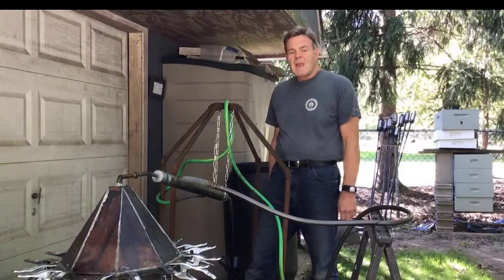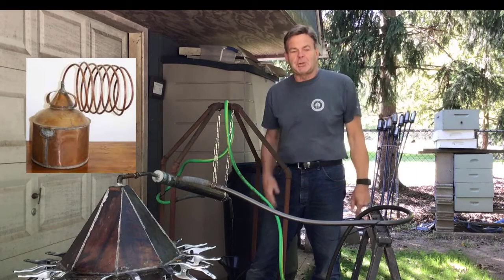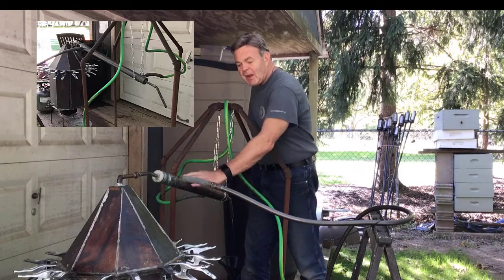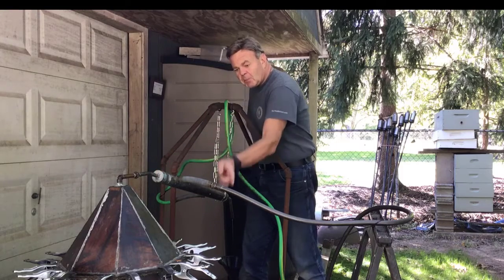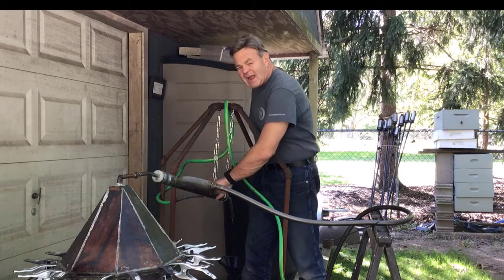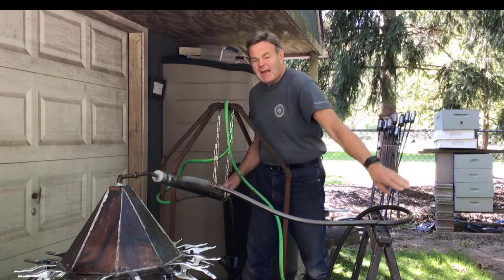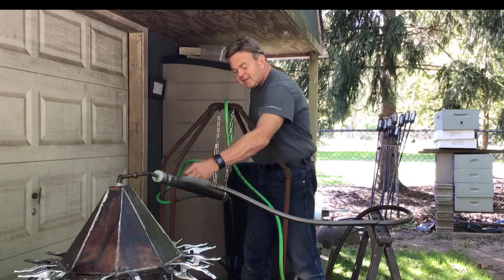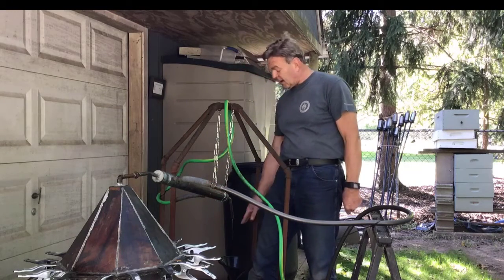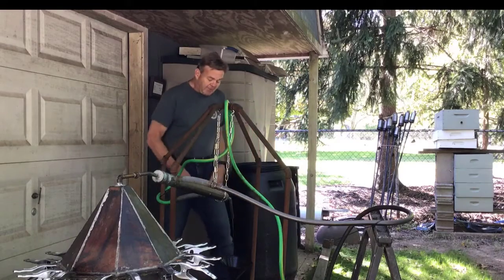Most of you have probably seen pictures of stills with that large coil of copper tubing they call a worm. We could have that here, but instead we've condensed that into this heat exchanger. We have a tube coming off the still — that would normally be our worm to condense the steam into liquid — but instead we placed it in a jacket that we're cooling with cold water. Water comes in the bottom of this water jacket and exits at the top. The steam comes in through that pipe to the center, and as it travels down, the cool water brings it under 173 degrees so it becomes liquid alcohol again. It comes out the end — down here we have our alcohol coming out.